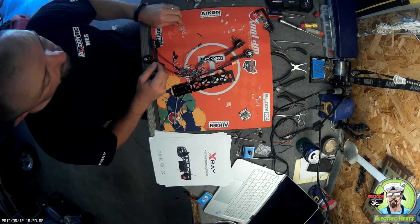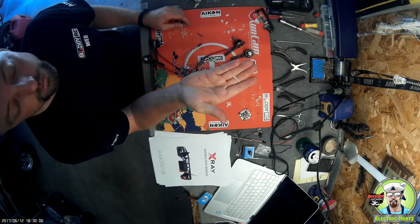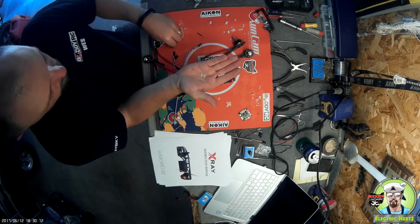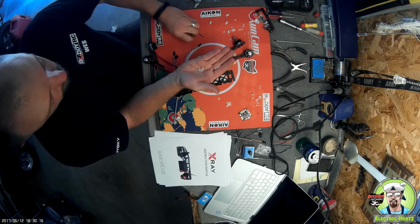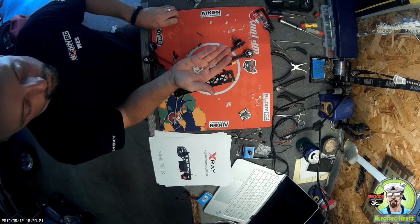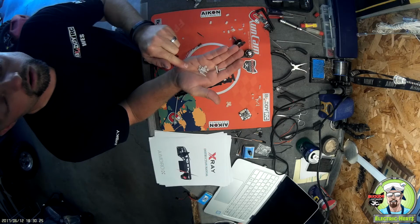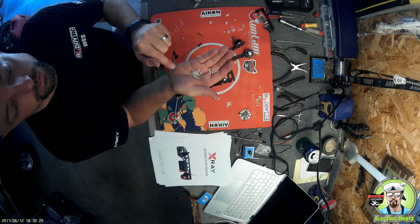The flight controller states that it needs an 18mm nylon bolt, needs to be cut down to 15mm, needs to use an 8mm spacer, and M3 nuts. The flight controller nylon hardware is found in the additional nylon accessories Ziploc bag.